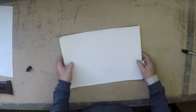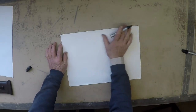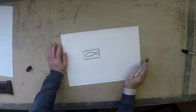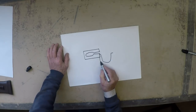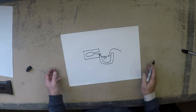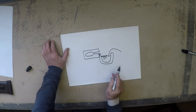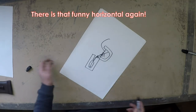In the 1960s a company in America called Stahl decided this was a good way to make castings. But they didn't quite do it as well as Derville would have liked. They set a mould up horizontally with a basin above it, filled the basin with metal, then tilted it all back — and they thought this was equivalent to Derville's process. Unfortunately it isn't. By the time the metal starts to enter the die, the whole lot is at a steep angle, so the metal hurtles down and splashes and plops, and you're back to square one.